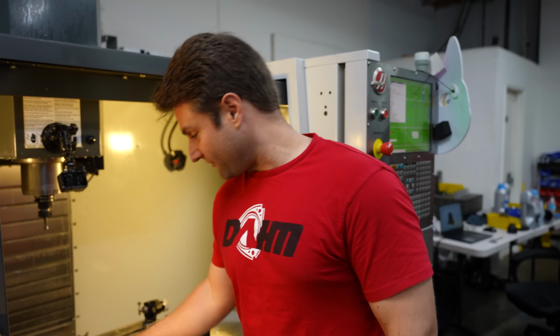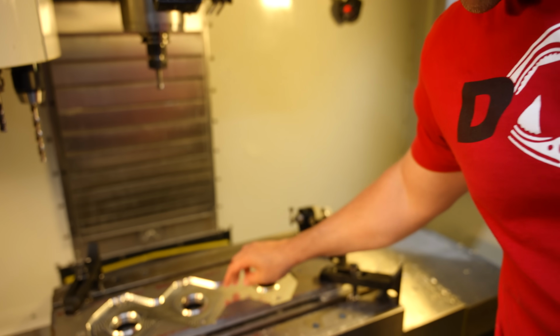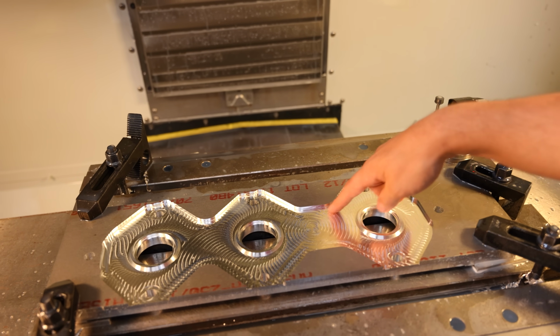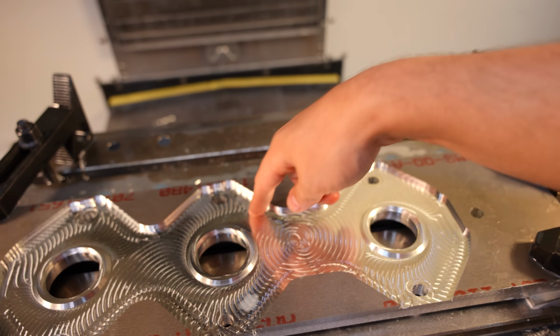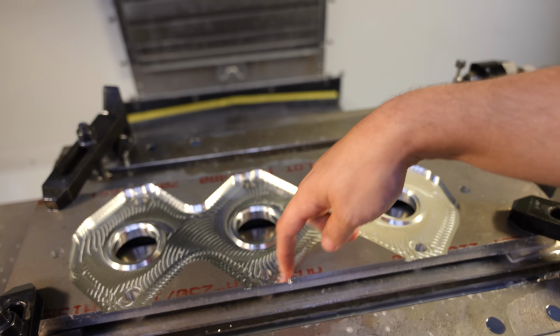That is the current version of the finish. Oh, that feels pretty damn smooth too. It is finally time to do the last operation on this, which is cutting this out here. But as you can see, you can actually feel it. Every time it's hitting this outer area, it causes the tool to bend the slightest bit. Well, this area is all nice and smooth. There's a little bit of chatter all along here.